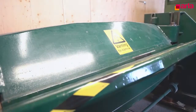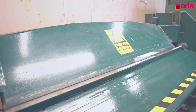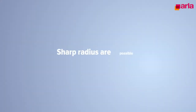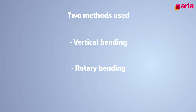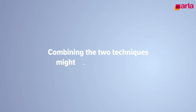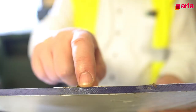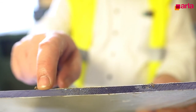When cold bending — brake forming — the sheet is forced to bend over a metal profile or knife. Sharp radii are possible but not preferred. There are two methods used: vertical bending and rotary bending. Rotary bending is preferred as it leads to lower internal tensions, as the sheet has more freedom when bent. Combining the two techniques might give the best result. Always use sheets with smooth edges and never try to alter the angle of the bend after forming.